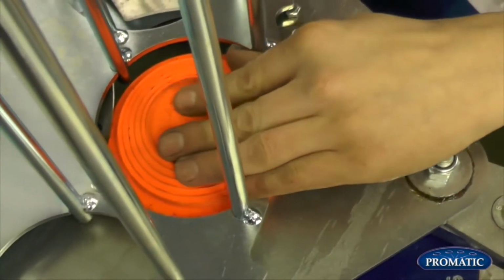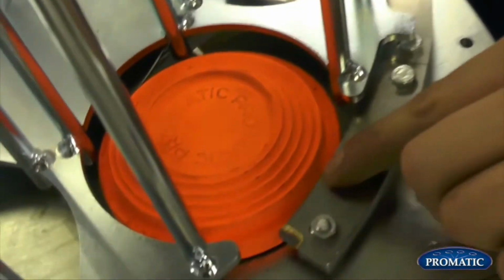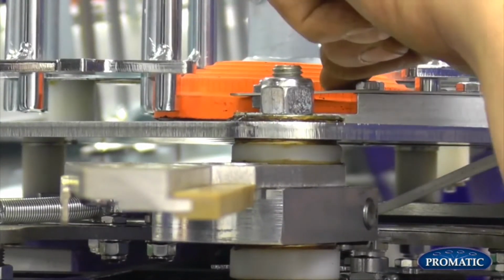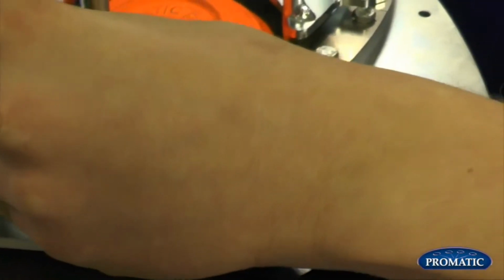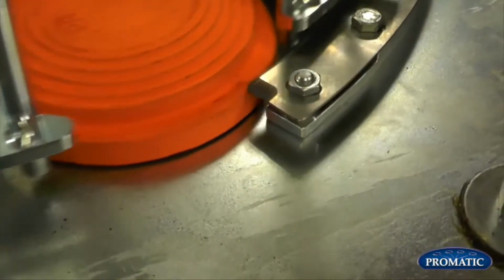Okay, what we've got at the moment, as the clay is coming in, we see it's not getting in contact with the blades at all. Where the drive band of the clay is here, we don't want the blade on the inside where it's been linished there to touch it. So we're looking for the clay to pass through without touching the knives. In regards to adjustment, we're looking for the thickness of your thumbnail for your height. We'll just take that back now.